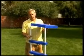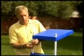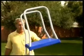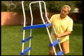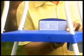If you have a 48-inch or 121 centimeter ladder, follow the previous steps to assemble the legs and then attach the support board, inserting the screws, but do not tighten. Next, attach the curved handles and insert the screws. Again, don't tighten. Connect the remaining legs and tighten all screws. Please note, refer to the printed manual to determine which hardware to use and where. To complete assembly, fix the warning boards to the platform.